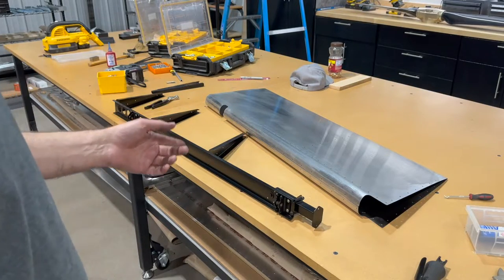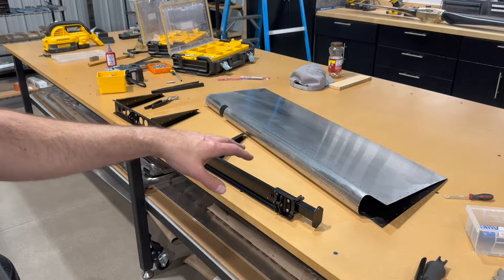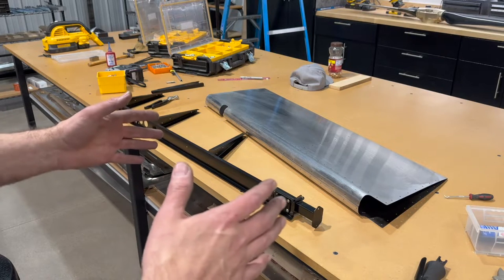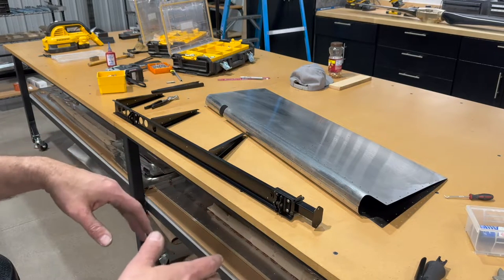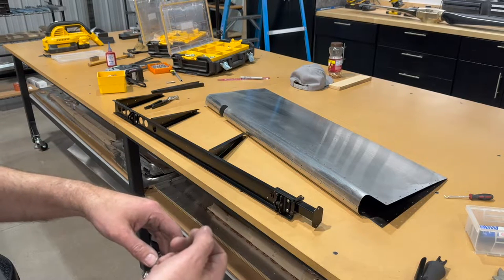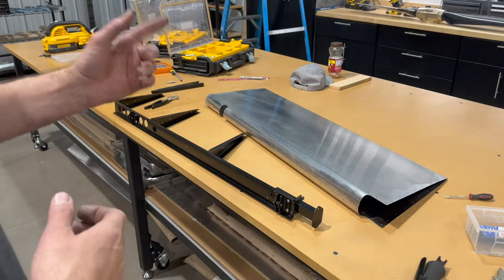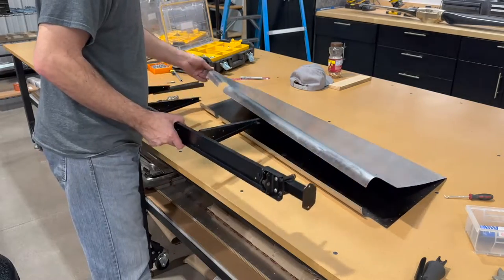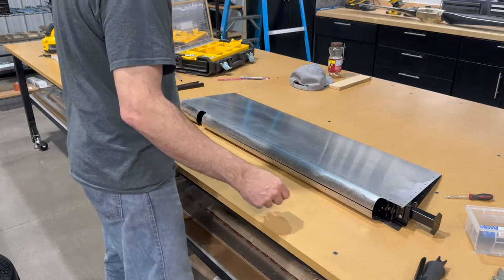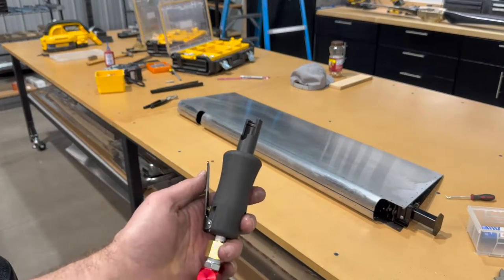I'm gonna go ahead and put the rudder framework in the rudder skin, get it clecoed up, and start working on getting everything set for the twist so I can match drill the opposite side and then proceed to deburr and then get the rudder assembled. It's going to give me the opportunity to use my new toy. It's a pneumatic cleco driver,